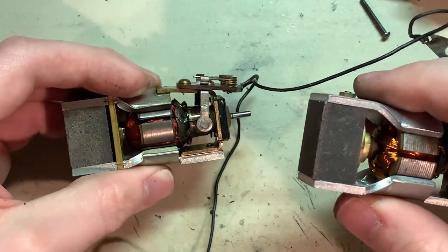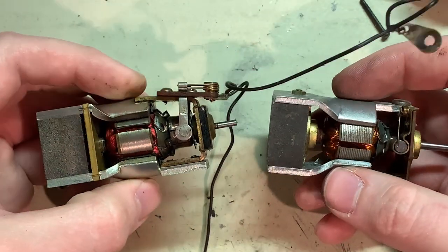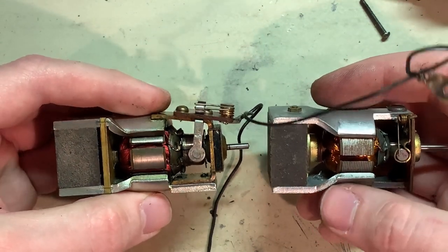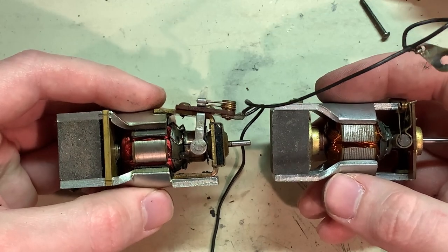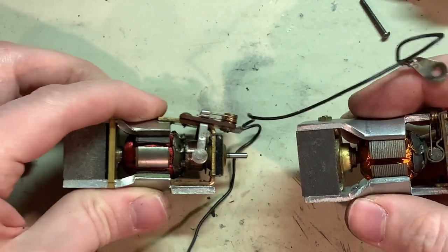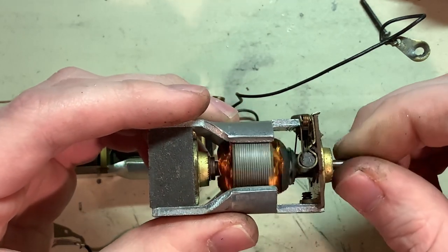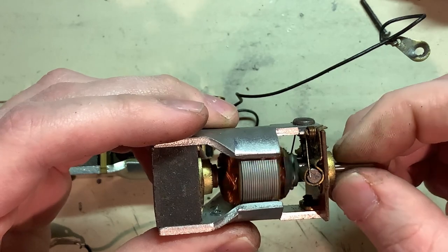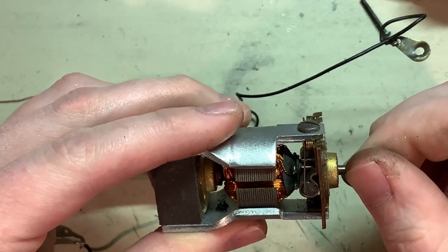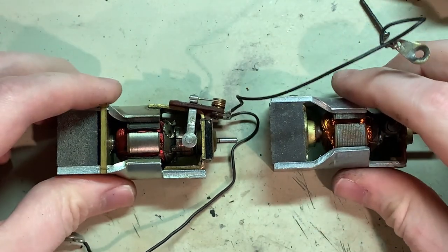The magnet on the back is smaller, and it has a 5-pole armature instead of a 7-pole armature. The overall construction of it is also just a bit cheaper, lighter, and simpler too, so it's definitely understandable why it was a much less expensive option than the DC-91. I've also found that even though the DC-90 uses a bit less current when it's running free, it actually has a higher stall current than the DC-91. I think it was somewhere close to about 4 or 5 amps, but my power supply doesn't go that high, so I couldn't check for sure. They're both good motors, though.